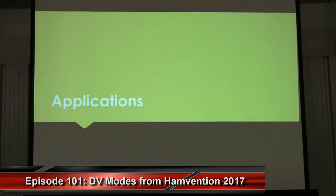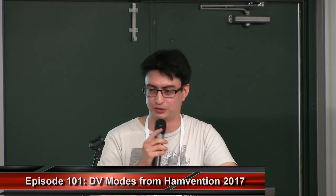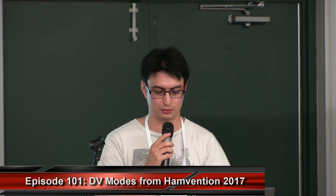One application people use RTL-SDRs for is monitoring WSPR. If you have an HF-capable RTL-SDR, you can set up a very cheap $20 WSPR receiver. On YouTube, check out the channel VeryOK, who shows how to set up an extremely simple WSPR monitoring setup using an RTL-SDR dongle with direct sampling mode and just a simple long wire antenna plugged in. The setup steps are: synchronize your PC clock to NTP, plug in your RTL-SDR, tune to a WSPR frequency, and pipe that audio into WSPR-X, the WSPR decoding program.